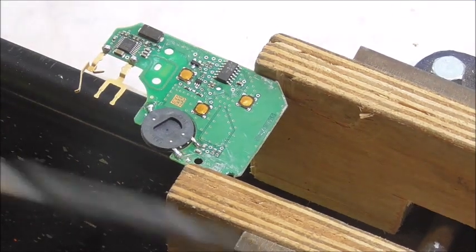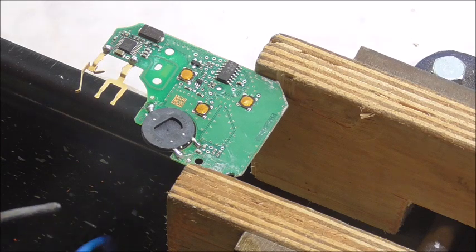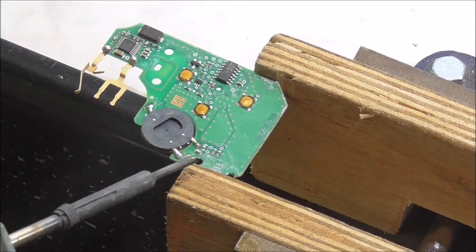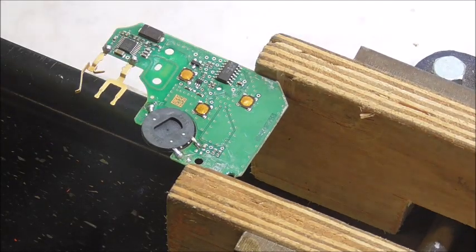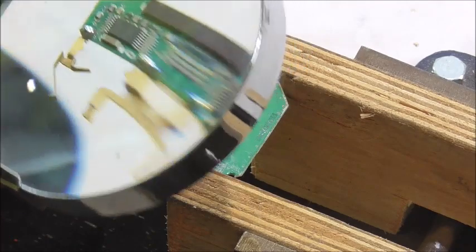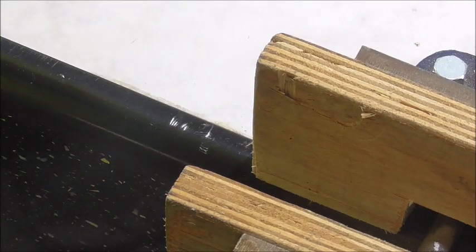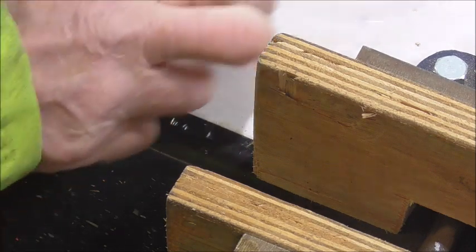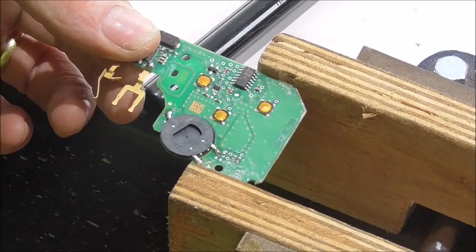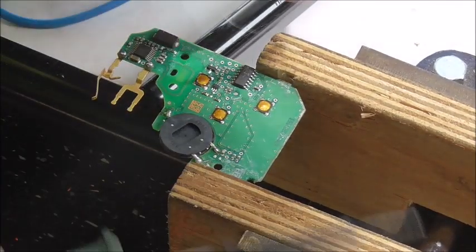Right, I just want to warm up the spot I'm going to, which would be there. Okay, I'm going to examine that again because it seems to have opened something up. Right, that's a solder bridge that it seems was needed. So I shall replace that solder bridge, the little 2 points there just soldered together. Again, I'll use the same wire as the solder bridge.